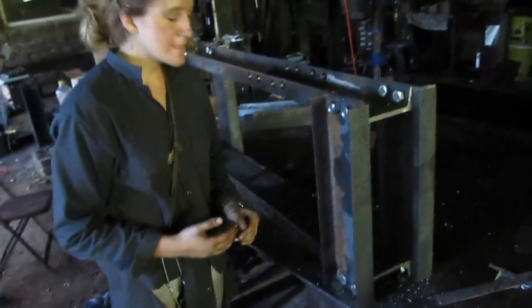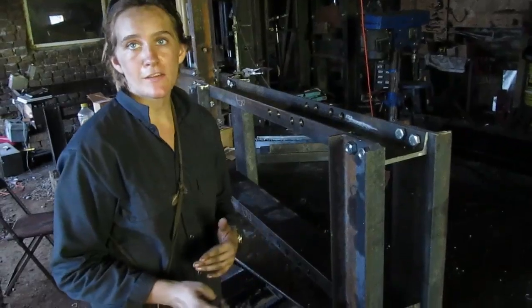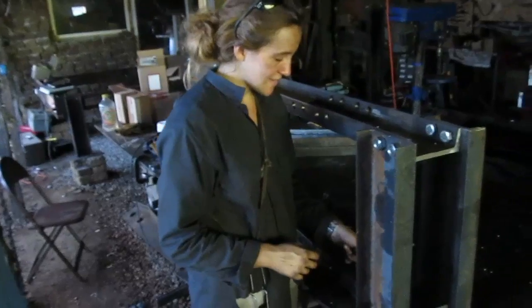What is the exact location of that hole? Do you have that documented somewhere on the wiki? It's not on the wiki yet, I'm still working on the frame. The center is 9 and 5/16 inches in this direction, and 2 inches in this direction. And they need to be on the same side, because you can't have the rollers on opposite sides.